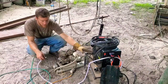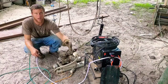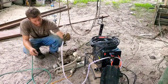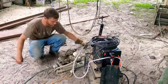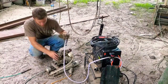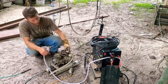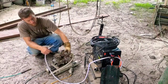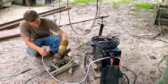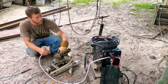But with this little thing, it can fit on this cart, and you just have to have a separate plug. It's not built into the machine, but I just plug this into 110, my machine into 240, and I can start cutting and cut constantly. As long as my machine will cut, this thing puts out the air to do it. Maybe you can find an old oxygen concentrator somewhere and do a build similar to this. Also, on the input of the compressor, I just put this little filter on here to keep debris from getting inside the compressor. I don't know how long this will last, but I've been doing this for about a year now and it works fantastic.